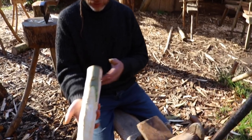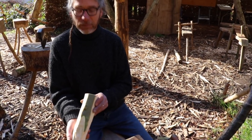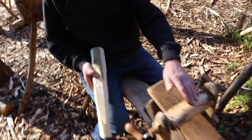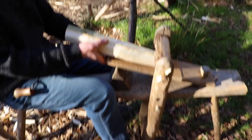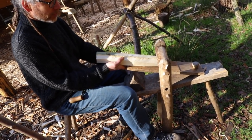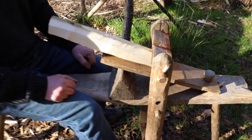So with the axe work done, what's the next part of the process? The next part is to round the billet closer to a cylinder. We've got rough corners — it's six-sided, a hexagon at the end — and we want to get rid of those facets so it's closer to a cylinder. To do that, we'll sit on the shaving horse and use the draw knife. Hold the billet in the shaving horse — you can adjust it depending on the size of your work, push it further forward or back to get more grip. And now we're ready to go.